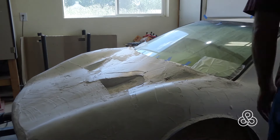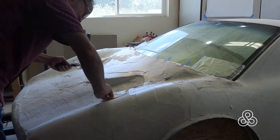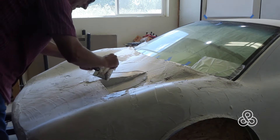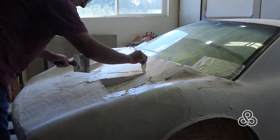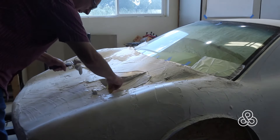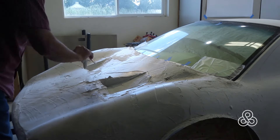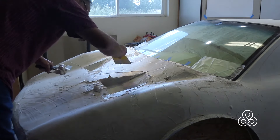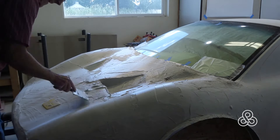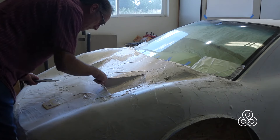This is about the third stage of putting on plaster. I just apply it either by smearing it right on with my hand or with a squeegee as you see here. As I showed before, when you need to cut out places you can go back with another piece of burlap to fill the hole and keep building up the plaster. For the second and third stage coats I use drywall mud, which doesn't have to be mixed — you just take it right out of the bucket or box, put it on, and it air dries. If you get it thick it does crack, but you just go back to the next layer and fill all the cracks.